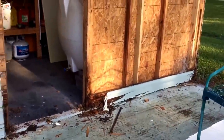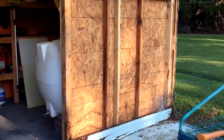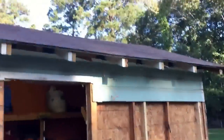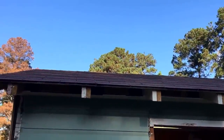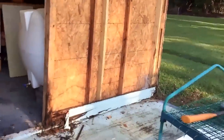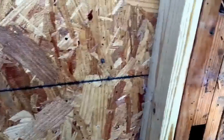I wish I had torn this down all those years ago. For 20-plus years I've been trying to make a purse out of a sow's ear here. I've already had to rebuild the roof years ago, I've put new siding on countless times, and there's no two-foot centers, no 16-inch centers. Let me show you the original two-by-fours — that might be a two-foot center, and then this is about a three-foot center. I had to add a couple of studs myself when I put this interior wall in.